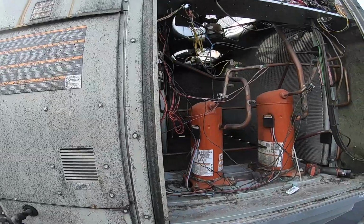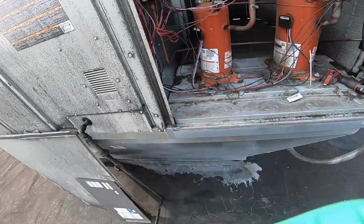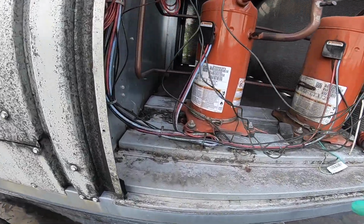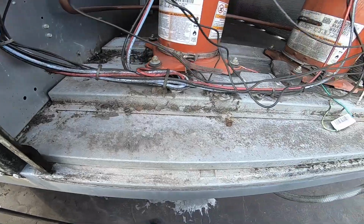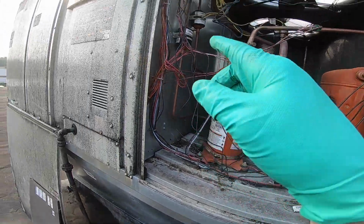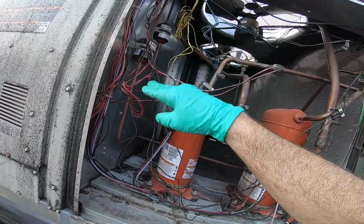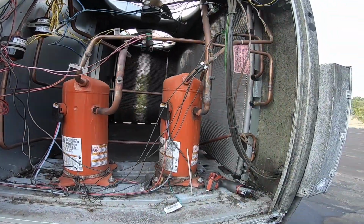I'm sorry if I get any of you guys dizzy now. I'm putting you guys on. I spotted something. As I put you on, I noticed that somebody's done the igniter, but of course, every igniter does the flame sense, so that's common on these. Somebody's gone through the low voltage wiring already. Not in a while though, they're all dirty and filthy, but there's been some kind of electrical work going on here.